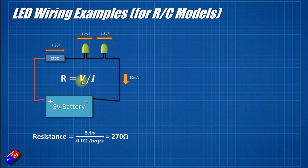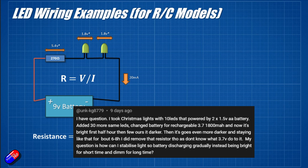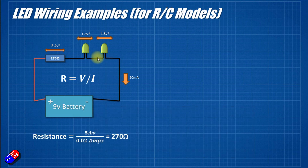This is great news because we can now use Ohm's law. Resistance equals voltage divided by current. So the resistance is 5.4V divided by 0.02A (20mA), which gives us 270 ohms. If we're going to build this circuit with nicely bright LEDs, I would put a resistor of about 270 ohms in this position to limit the current and drop the required voltage so the LEDs work for a long time. So that's the answer for Antworm09 — I wouldn't use 12V LEDs. Wire both LEDs in series to the battery with a 270 ohm resistor; they'll be bright and you're using one lot of 20mA to power both.